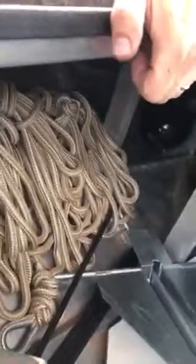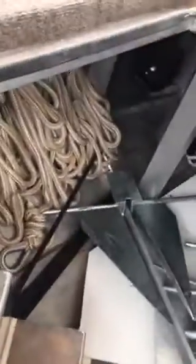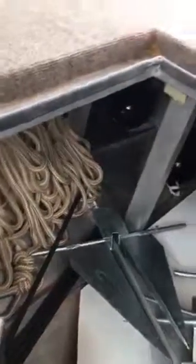This compartment has the ropes on this side, the shore power cord, some other ropes. We've got plenty of ropes, brand new bumpers. This is where the box with the eight inverter batteries are — there's four on this box and four on the box next to it. Those are run in parallel to a 12-volt system. I had said it was a 24-volt, but we went back to a 12-volt system because of the inverter. In here: shovels, sledgehammer, some extra clevises, all our anchors. There's four big anchors and two smaller anchors. These are some lines that are measured from the back cleats to this front area, if you want to put those on in the dock area to have lines readily available at the front of the boat, and then you can run your longer lines to them.